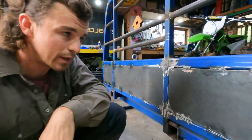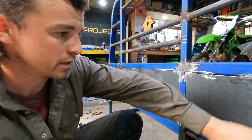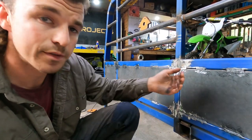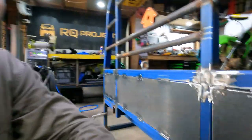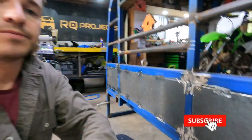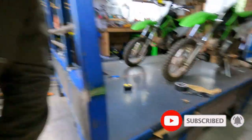I have sort of finish welded that, so I'm just stitching this for now — I've got a 50mm stitch every here and there, and I'll go through with Sikaflex from the other side. I'll put masking tape over this and Sikaflex it from the other side to seal off the gap, because it is a little bit gappy in spots, but it's really strong — I'm happy with it. Now, for the tie rails.